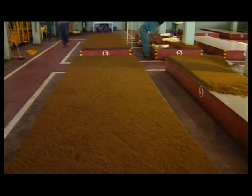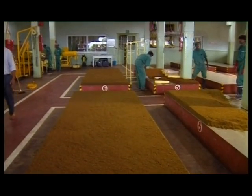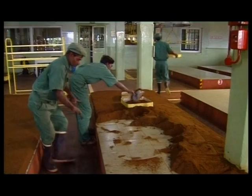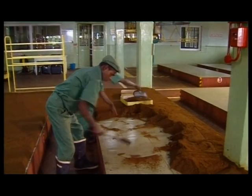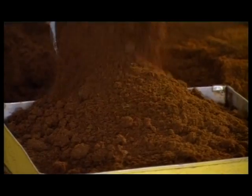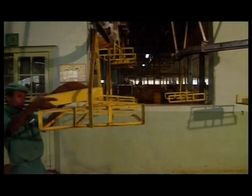Mild acidification of the oxidized tea increases levels of tea theaflavins. During this process, the green leaf is converted to black tea. Fermentation determines the color, strength and quality of the tea in your cup. This process may take as long as 3 hours. At times during the peak quality season, the fermentation period may be 45 minutes or even less.